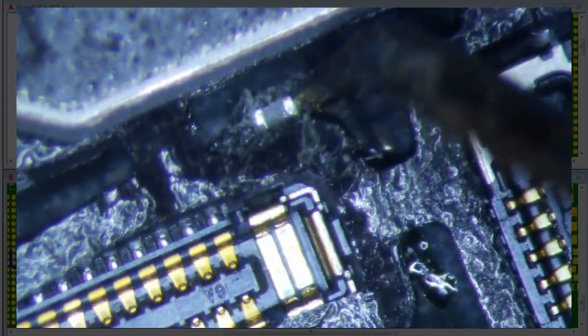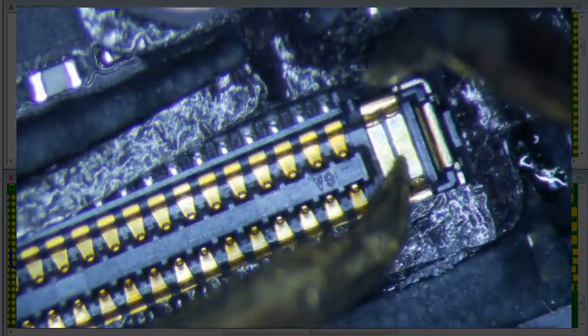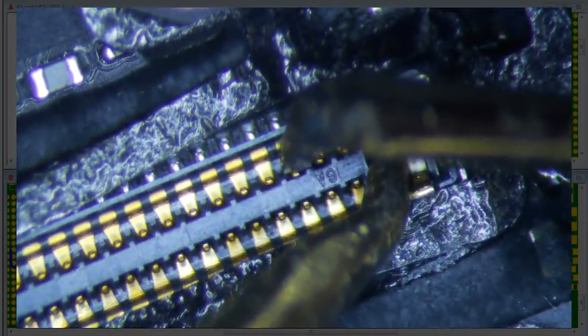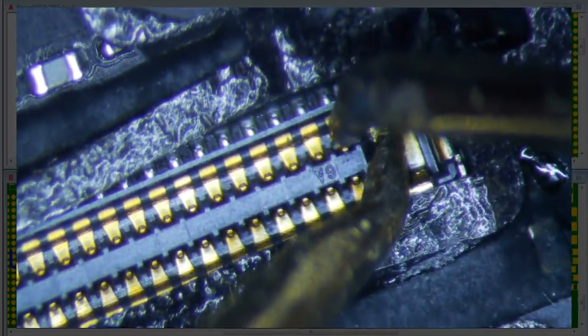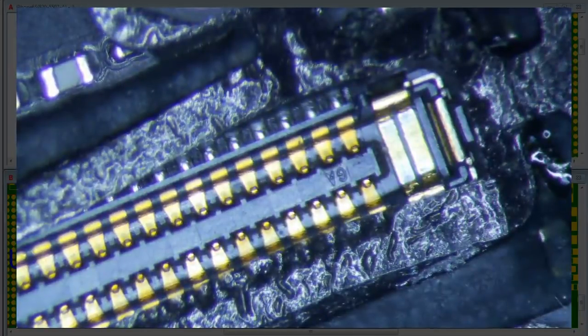And it's pretty tight. Doesn't look like it's blown. You can check diode mode on the two cathode pins on each side: 0.615, 0.012, and 0.614. So this is actually shorted. It's not a backlight filter problem. I think most people will probably be like, all right, let's just replace the backlight filter anyways. But I'm not going to do that because that's not the problem.